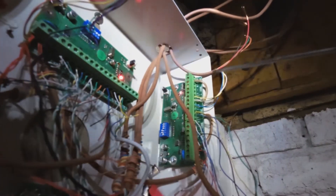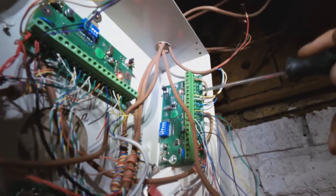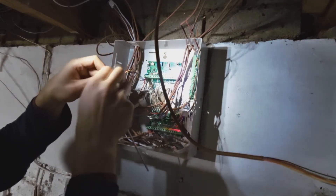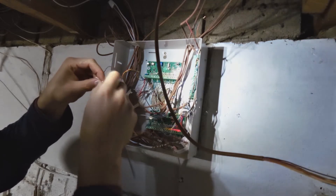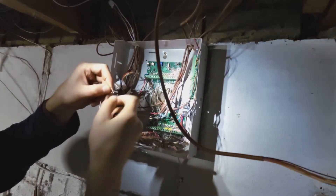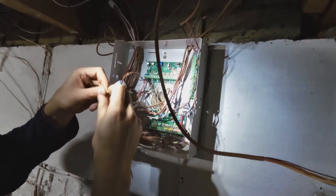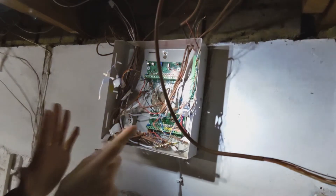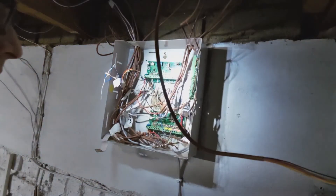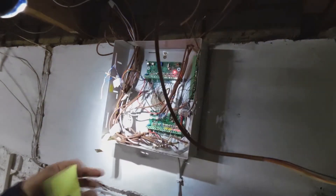On the expander board — this is expander 6 — I have two zones open: seven and eight. I'm going to put the smoke detector on zone 7. I need to determine if the smoke detector is normally open or normally closed. This smoke detector is currently in the default position, which is normally open — meaning under normal conditions the relay is open, and when it senses smoke it will close the relay. Most alarm systems can deal with that condition, so the most important thing is which option you have configured.